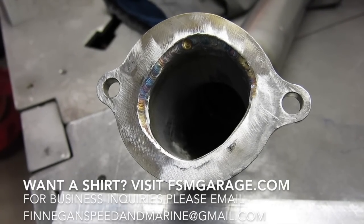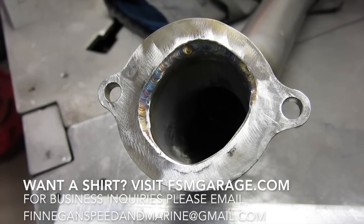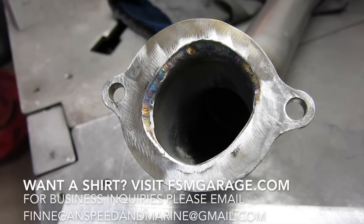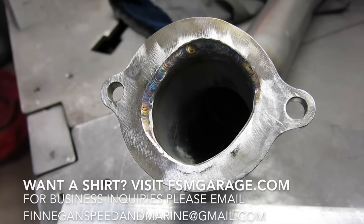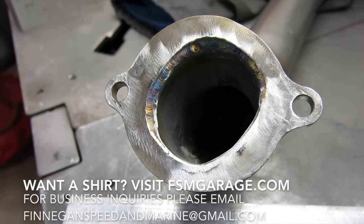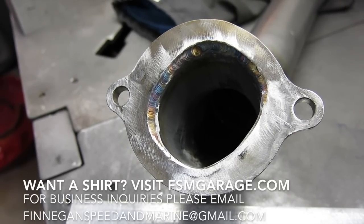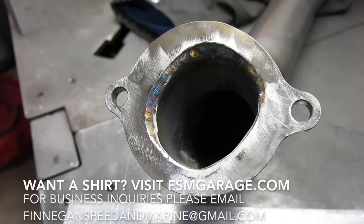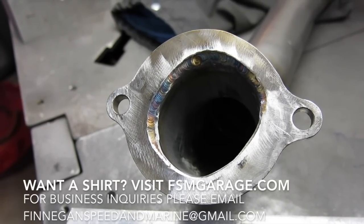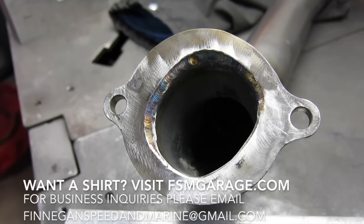Here's a look at the completely welded flange, at least on the back side. You'll notice that I've gone and resurfaced the flange to make sure it's flat, but overall I'm happy with it. It's got good color, good penetration. What's left to do now is weld the front side of all these flanges and then weld the sleeves onto the primary tubes, reassemble the header, and then figure out where I'm going to mount the turbos.